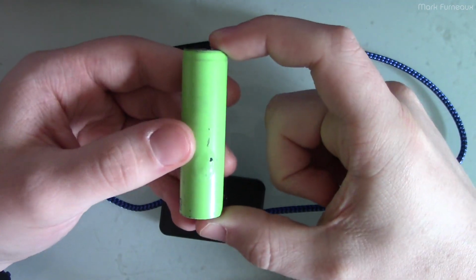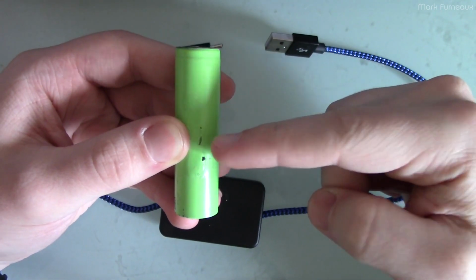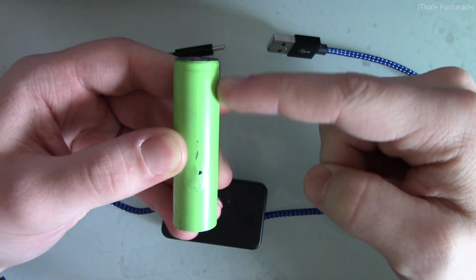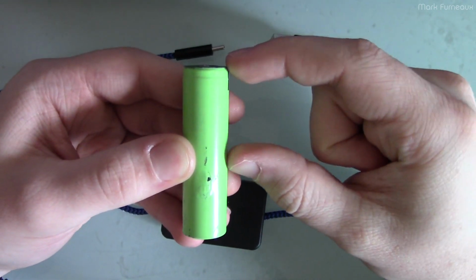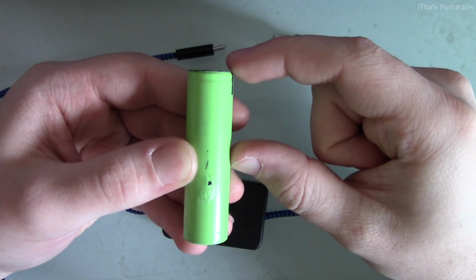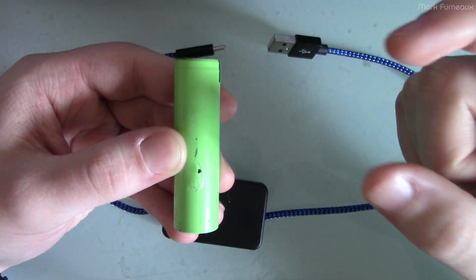Now, if I took the same battery and I had it fully charged, I discharged it 50% of the way to 50% state of charge, and then charged it back up again, and then I did that twice, so I had two 50% depth of discharges, and so 50 plus 50 is 100. I've still got the same amount of energy I've pulled out of that battery.